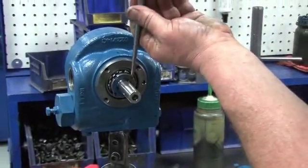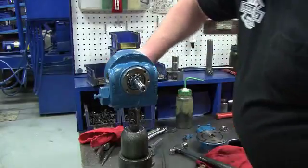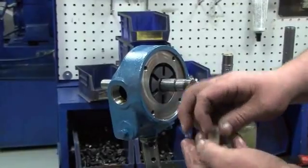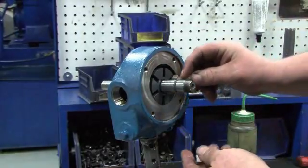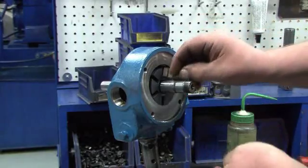Then use a hammer and a punch or Blackmer's lock nut tool to tighten it until you can't turn the rotor anymore. Next, install the vanes into the rotor with the open vane slot toward the valve. If installed correctly, the vane slot will be facing the discharge port. The vane slots would be visible when looking into the discharge port.